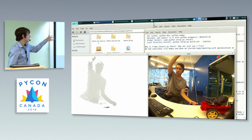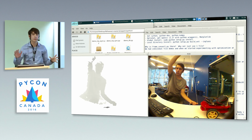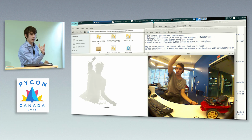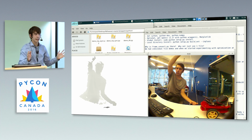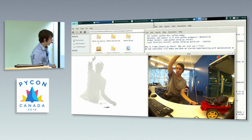So in testing it out to see what its limits were, I found what it cannot detect. The way it works is it projects an infrared beam array onto all the objects, and it looks at the two different points of it between them, and from that it's able to generate an array. Therefore, if two points do not render beside each other, it doesn't understand an object. So if you don't have a flat object, say this size, about 1 inch, 2 inches, it doesn't render it. For example, like that piece of wire.